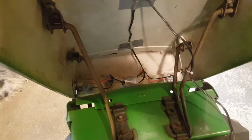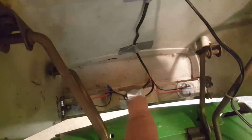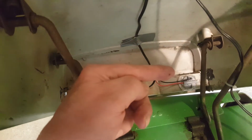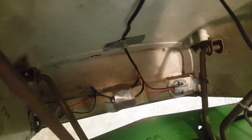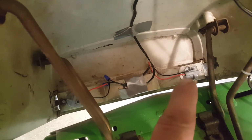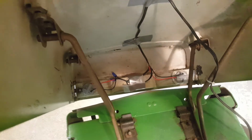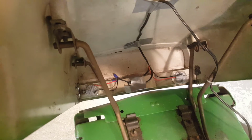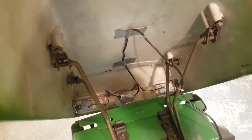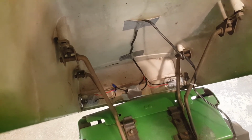Hang on. My LED headlights. The one in the middle was just a long little strip light that I had that I repurposed. Then I bought a proper connector for each side that accepts a type 1156 lamp. And then I bought LED replacement lamps for the type 1156. And just did a quick 5-minute hokey wiring job, but it works. I'll show you the lights from the front in a minute when I close the hood.